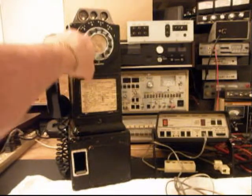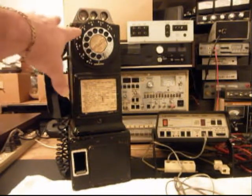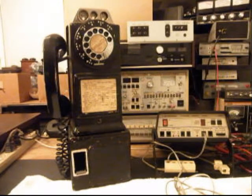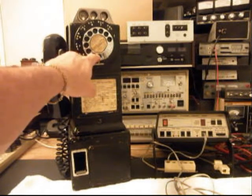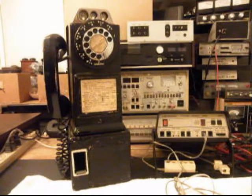The other thing on this telephone is we want to go through the rotary, and we want to make sure that it's oiled, and we want to make sure that the numbers are racking off properly. So we want to oil it and adjust the points and go through that, because it looks like it's a little sluggish. So we'll get that squared away. We want to make sure that the money is dropping through the quarters, dimes, and nickels, and so we'll get into that part of it.